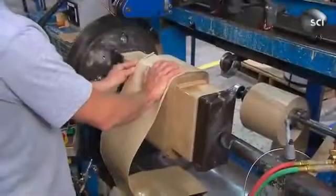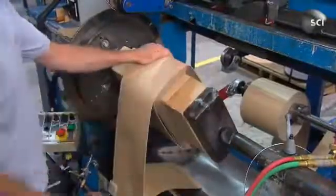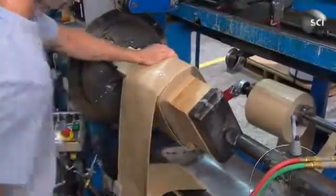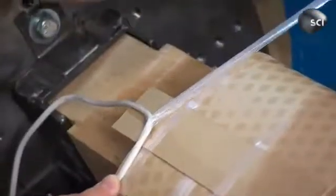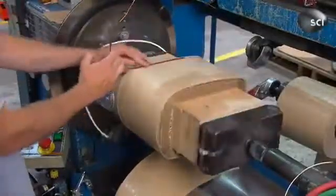The insulating paper has epoxy glue on both sides. This glue will later melt and bond several components in place. On the next block, a worker tapes on more epoxy paper, along with epoxy coated copper wire.